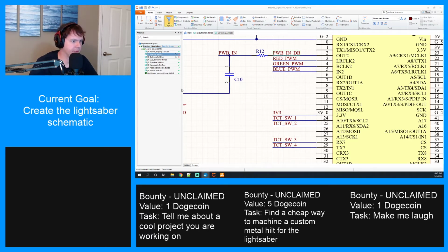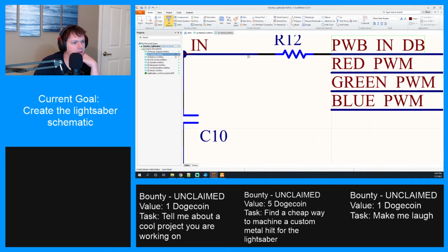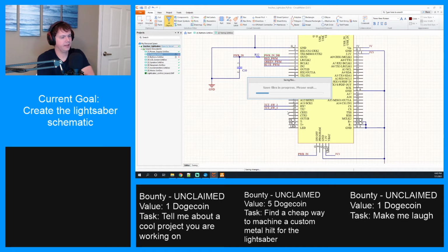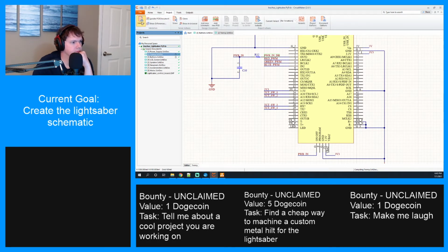Oh, I forgot to add the resistors to the bill of materials around the buttons. What are they? R8 through R11. I guess it's through R12 now. Okay. Excellent. Let me go ahead and save all this to the server. And then I want to validate this and put it on the circuit board just to see it all there. Hopefully we don't get any errors. Nothing? Okay.